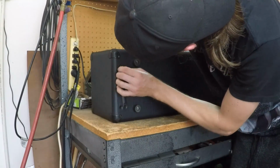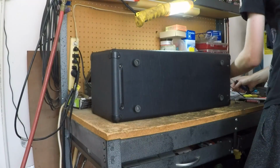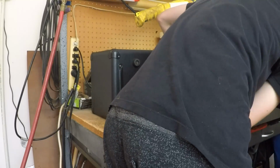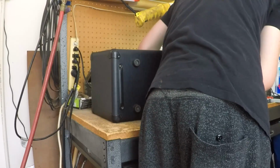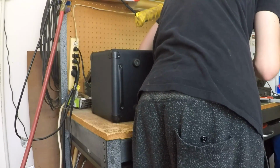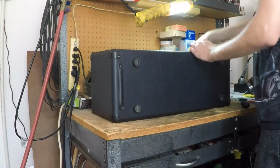Personally, I just set mine to the on position as I play metal, and the only pedal in my effects loop is a Fortin Zuul gate pedal. Also note that the mix knob for the effects loop will no longer be of use, as we effectively just sent 100% of the wet signal to the power section, which was the whole point of this mod. The level knob does still work and is essentially a tertiary volume knob. I just keep mine in the normal position at 12 o'clock.